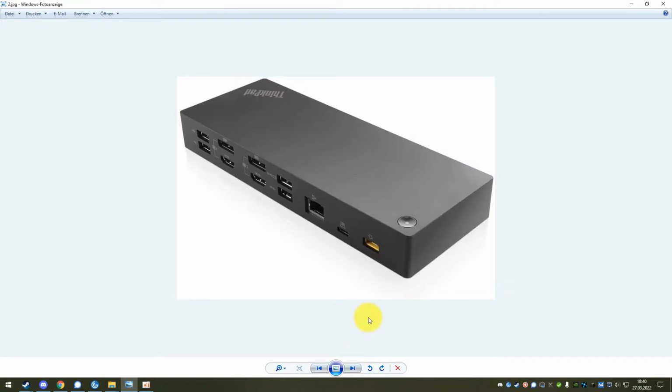The failure mode of these, as far as I know, is always the same. At some point in time they just stop working. When you plug the charger in, the light doesn't come on anymore. And when you put your ear real close to the charger, you can hear a clicking sound once every second. That usually means that your charger is detecting an overcurrent or a short circuit on the output and thus shutting down. So this thing develops a short circuit inside, and I will talk about why that happens later in this video, and also how you can fix that in this case.